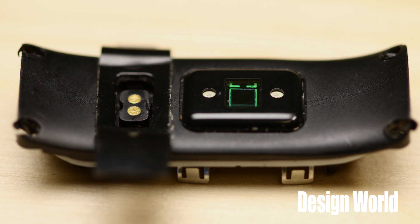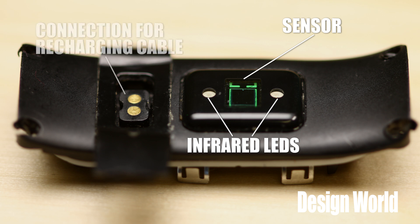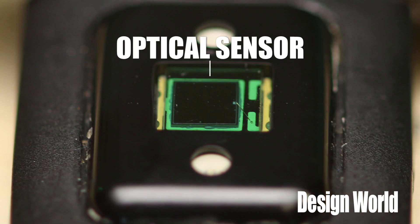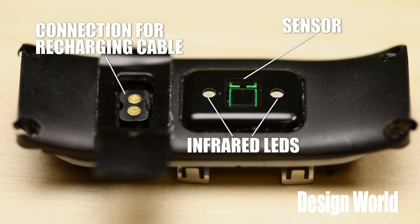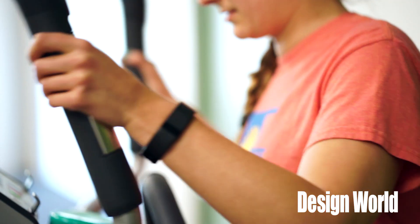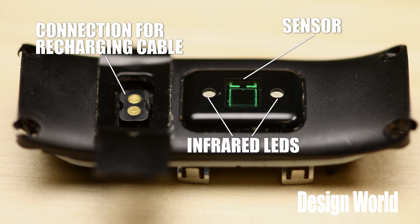So exactly what are we looking at in this close-up? What you see here is both a sensor and a couple of dots. The dots are infrared LEDs. The two prongs above the sensor assembly comprise the connection for the recharging cable. The sensor is actually an optical sensor that detects light from the LEDs reflecting from your skin. The optical sensor and the LEDs collectively make up an optical heart rate sensor that works via pulse oximetry — a measurement technique that takes advantage of the fact that oxygenated and deoxygenated hemoglobin have different optical properties. With every heartbeat, there's a spike in arterial oxygenated blood, which is detected as a change in the absorbance or reflectance of LED light. So the optical sensor measures the amount of LED light reflecting from the blood under your skin. The reflectance is a bit different during a heartbeat, and the sensor will detect this periodic signal from which the heart rate is extracted.